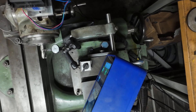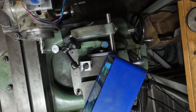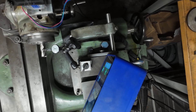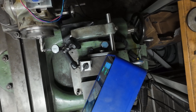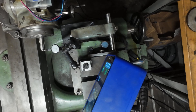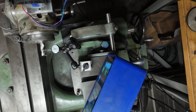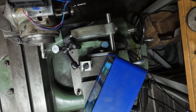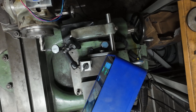The flutes are not perfectly parallel to the plane — that could be misalignment on the head or wear on the end mill. But what I want to show you is that with these settings we identified so easily, we are now following our flutes without any problems. And that is exactly what we want, because now we're gonna be grinding those flutes.